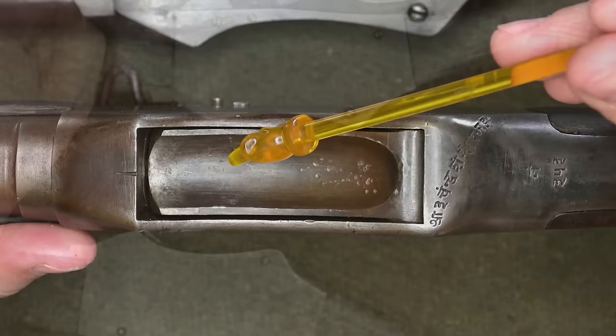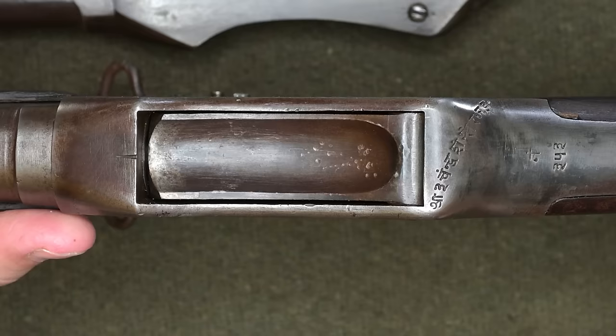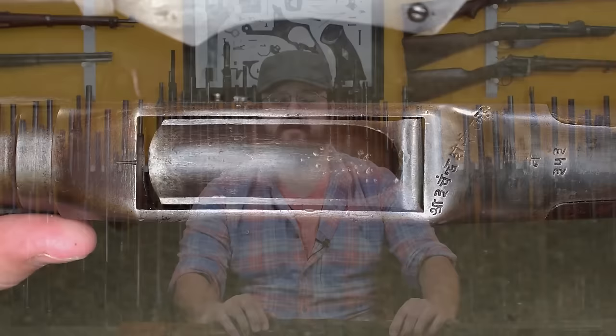Once the breech block isn't fully supported at the rear, and especially if it's allowed to travel rearward over time with the number of firings, that means the gap up here opens up, and you start to have the chances of venting gas or case failures, depending on how far back you make it. Generally, this shouldn't be enough to be disastrous, especially with a big rimmed cartridge, but it is going to get uncomfortable eventually. Drawbacks aside, the Gehendra managed to at least get the job done, a domestically made rifle in a hemisphere where such things were exceedingly rare.